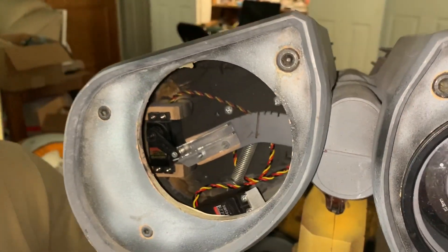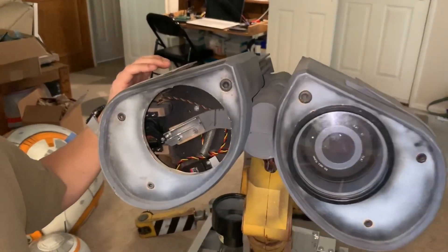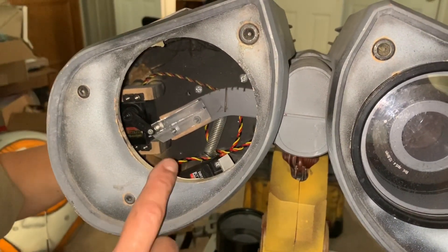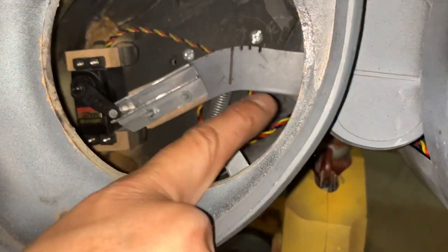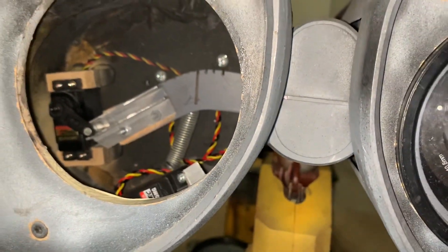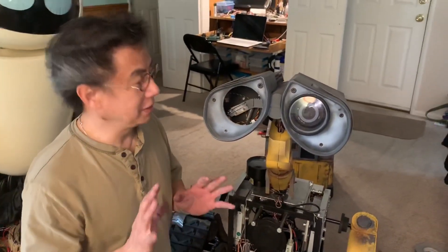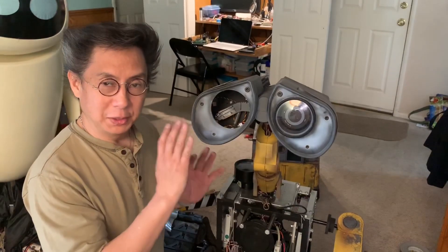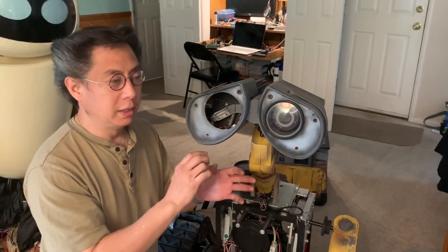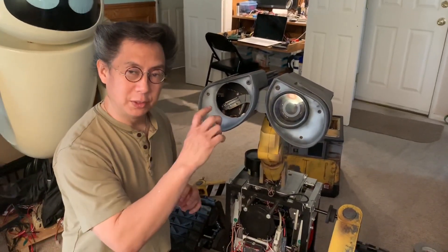In action you can see the spring helping. You can see the little notches I put on that bar — those are experiments with different amounts of tension. In the design and experimentation phase you need those adjustment points, so don't be afraid of drilling too many holes. Just put your spring in, try whatever attachment points you need, and experiment, because you won't know exactly what you need until you try it.